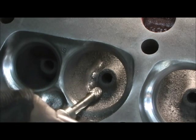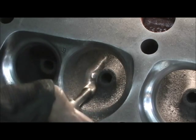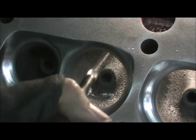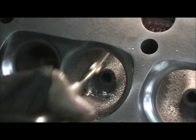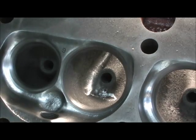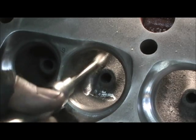Notice how it's coming over and hitting those casting humps — it won't reach down to it, so I've got to move this wall to accommodate it. Now I've got the wall dug. I've got to come over here and hit on this guide, pull over on the guide. Now I've got me some meat and that's a good 100 thousandths ditch I just dug. Now what I've got to do is come in here with this tool and move this wall over right here so I can get in there with an edge and straighten it out.